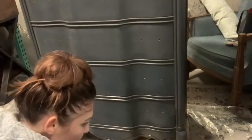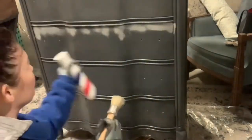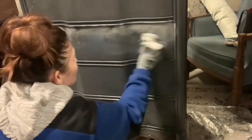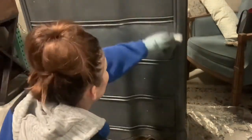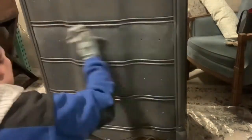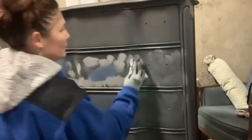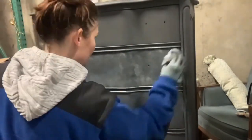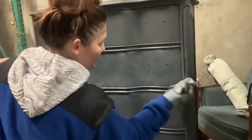I did want to add a little bit of blue to this, and you can't really see the blue at the end, but it adds kind of a pearlescent tinge to it. It's not like you look at it and see blue — you just kind of see, oh, that's interesting, it has a pearlescent type finish, which is really cool. You use a ton of water with this technique. My paint is so, so thin. And as I'm wiping it back, if it doesn't come off the way I like, I add more water and just blot it till I like the way that it looks.